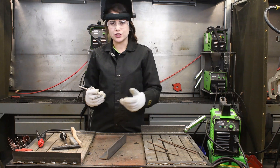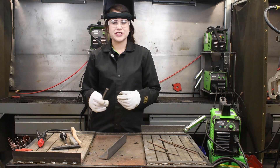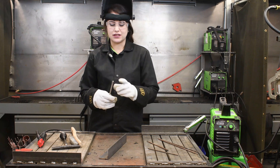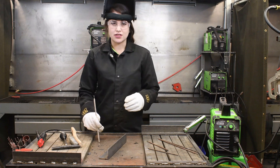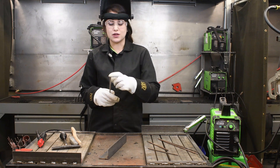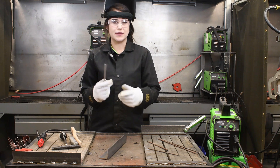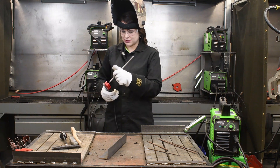This rod is a lot more fluid, so as you're welding, you're just kind of dragging it along and it's just filling in that space that is needed. When using the 7018 rod, after you've finished your weld, the same kind of flux that's covering your weld — that you clean off when done — is going to be created at the end of your rod. So what you can do is take your fingers and pinch that off, or rub it on the material, or use a file or pliers to break it off. But you only want to break it to the tip. If you go past the tip and remove that from the actual rod, it's not going to be easy to continue to weld and you'll basically have to get rid of that rod and start over.